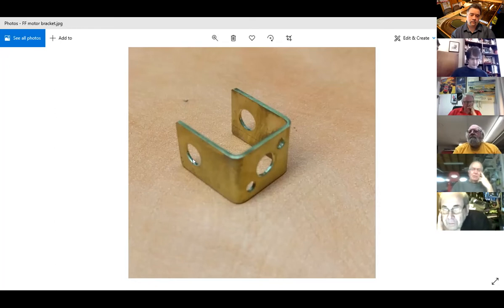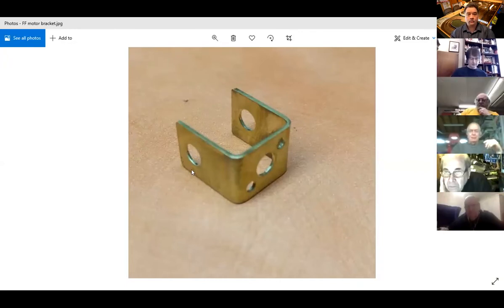The size of the hole at the back, I can make those either 3/16 where you just pop in a bushing or a bearing, or I can make them 7/32 if you want to put in a piece of brass tubing that then would take the 3/16 bearings on the outside. And I can also put in any kind of offset of the axle to the motor that you would like. For example, most of them are built with zero offset, where the center line of the axle holes is the same height as the center line of the motor. But if you wanted, for example, to use the slotted offset gears, I can move this up 40 thousandths, a millimeter higher, and then you get that little bit of lower center of gravity. I can do that because I make them to order, so I can do that for anybody.